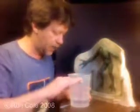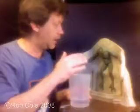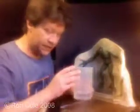from the first batch. The first batch is, in a sense, the most important batch, because that's the batch that will reproduce all of your surface details, and you need to be very careful in how you apply it, because you want to avoid missing spots that will end up just being gaps in your mold. And we'll get to that right after I mix up some plaster, which I'm ready to start doing right now.